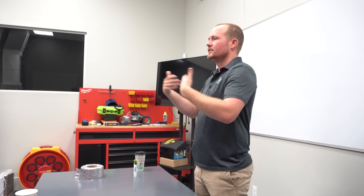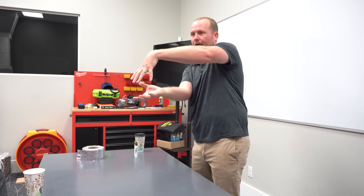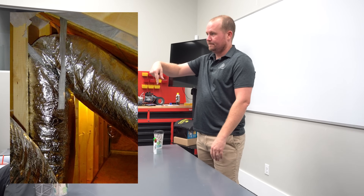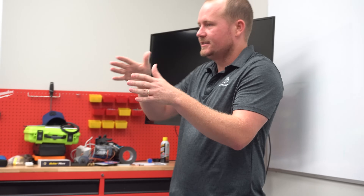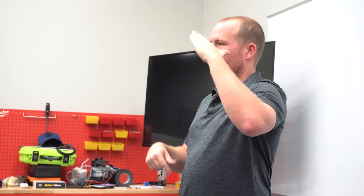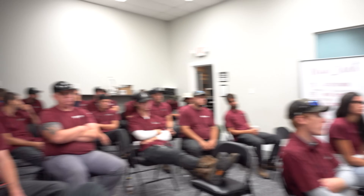When designing or installing a duct system, if you take a duct off the side of a plenum and immediately curve it around to make it fit somewhere, that radius is going to create a lot of turbulence. So what could you do instead? Let's say you have a really tight supply plenum in an attic near the corner of the roof and you need to make a quick 90. You could extend the box, or use a swivel 90.